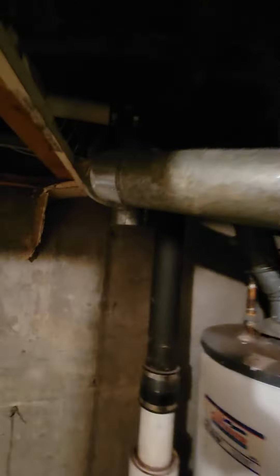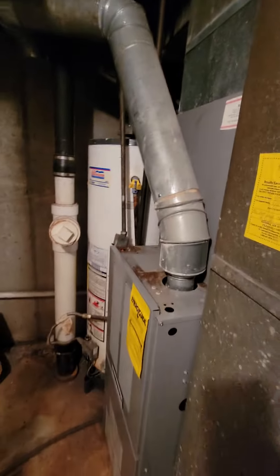For the flue, we'll do a new tee. They have a six-inch tee currently — a three and then a five — and we'll go down to a four. The shutoff is right there. For the panel, we have a double-30, so we should be good on size.